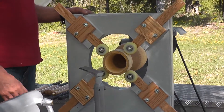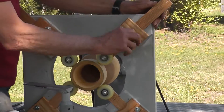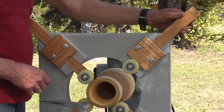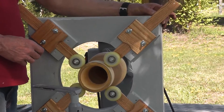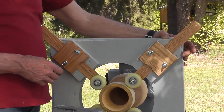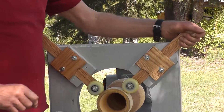Another thing I'd like you to note is my arms. I use this clamp here — it's easy to just loosen it and move them back or wherever you want them. The sides of the arm and the sides of the guides are tapered, so with very little pressure it locks extremely tight. It's something like the taper on a tailstock.